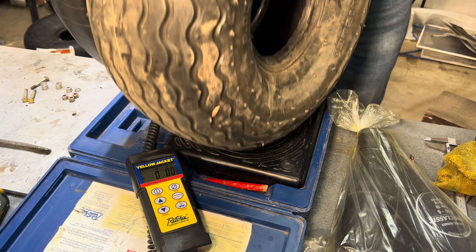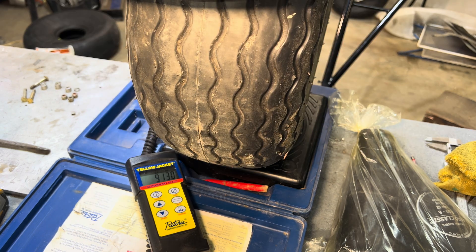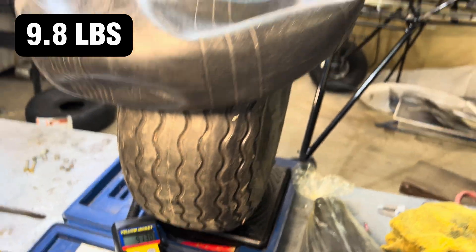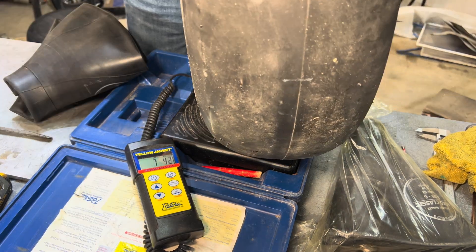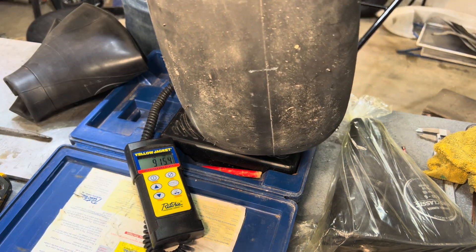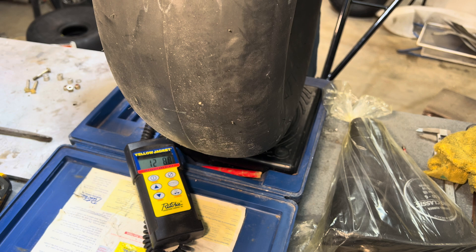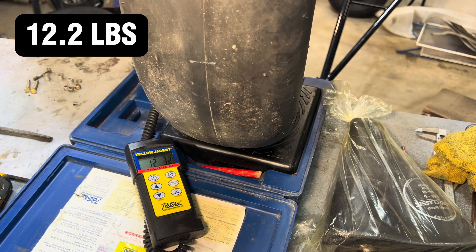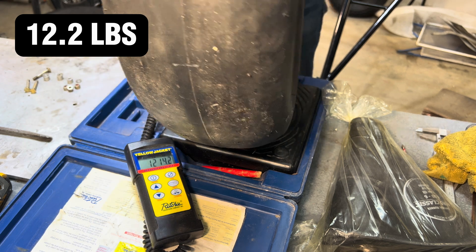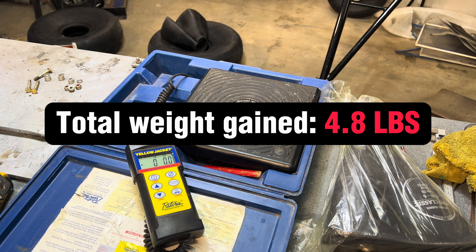Here's the smaller tire and the tube is just sitting on top of that. We got nine pounds, 13 ounces with the original tire setup. And then the oversized tire is around the same weight for just the tire alone. It's hard to balance this one. With the tube on there it looks like around 12 pounds — quite the difference, but it's still pretty light. Not too bad.